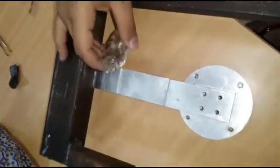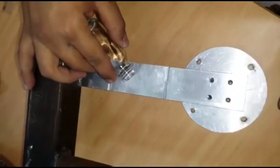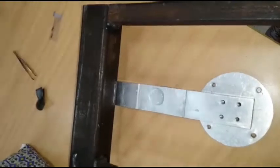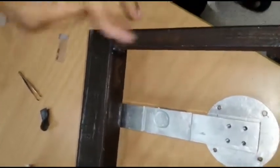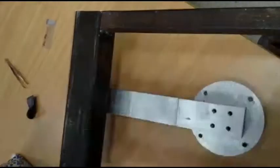The first step in the installation of the strain gauge is polishing to ensure that the surface is smooth and straight. After that, drops of distilled water are added to wipe away the aluminum powder generated, and then acetone is added to remove any dust and ensure a clean surface. The fourth step is to add alcohol.